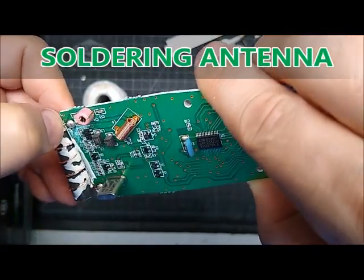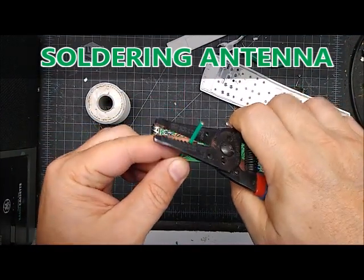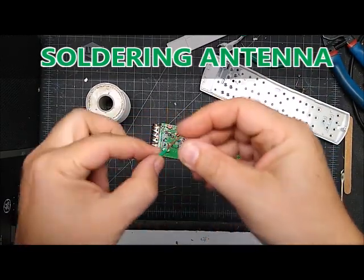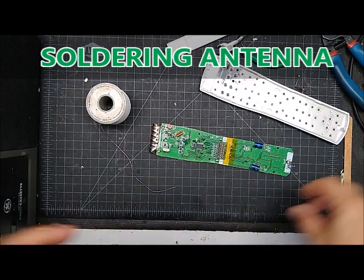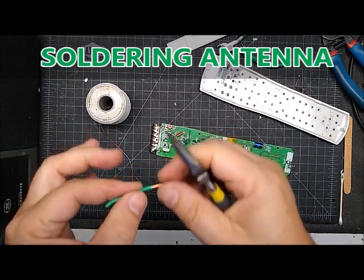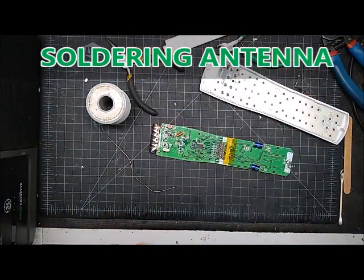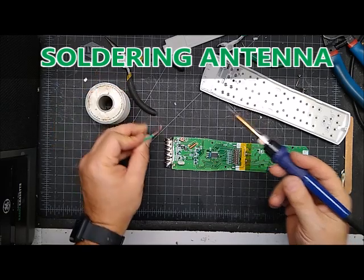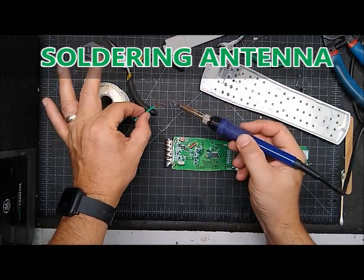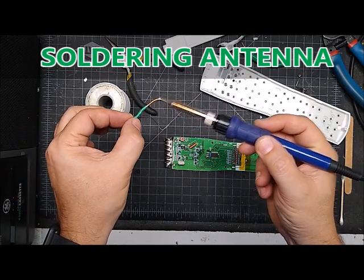It's not quite going to reach, so I'm going to add a piece of copper wire to bridge the gap. I've got a bigger piece — this is overkill for the size of the wire, but it's easier to hold and solder while I have this long piece rather than trying to deal with a tiny piece that'll just stick to the soldering iron. First I'll get a little bit of solder on this wire. The rest of the wire will get hot but I'm holding it kind of far up — I just want to get a little bit of solder on it so it's easier to deal with.